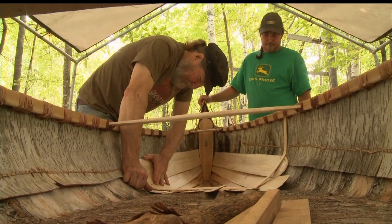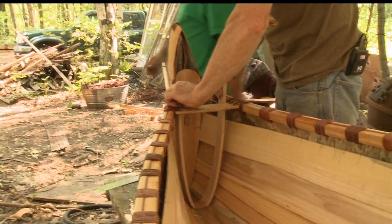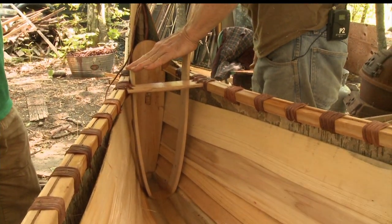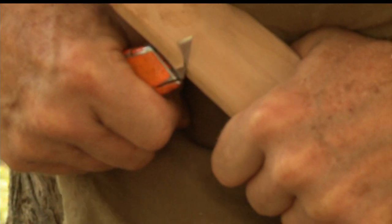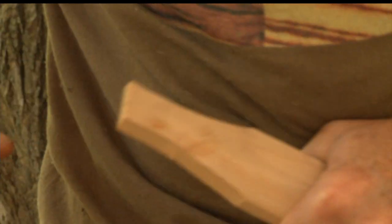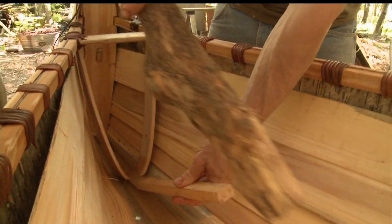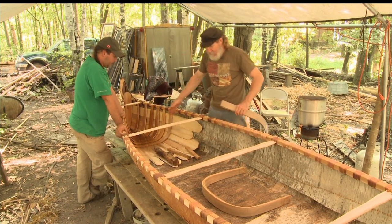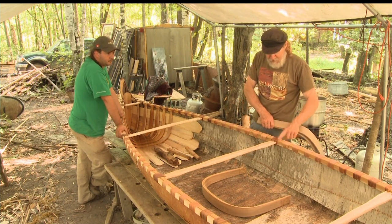One more wide piece of plank will probably get us close. Now, to fit the rib, what we do is we set it down in place where it's going to go. We'll hold it down and then I'll make a pencil mark at the top of the gunnels, and we taper out the ribs a little bit. Then we cut a 45-degree bevel and drive it into place — looks like it's probably going to fit perfect. We'll keep going until we put all the ribs in up to the center, and then we'll start from the other end. The last rib we put in will be the center one.